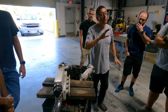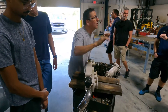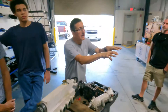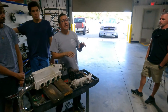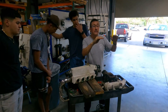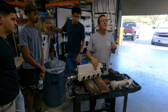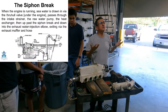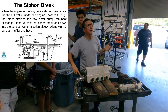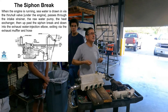Pay attention. Suppose this is the critical point. When I decide to install the generator in that area, I need to identify whether that area is located below the water line or above the water line. If it's located below the water line, that means — like an anti-siphon situation — I have permanent raw water here, and during cranking it's easy to suction water.